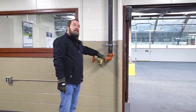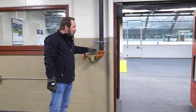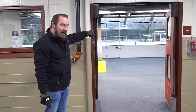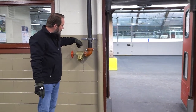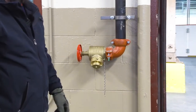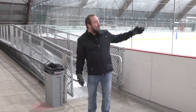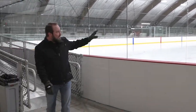This is the hose valve, off the wet system inside the main lobby and warming room. There are two of those throughout the property, and one behind the penalty box where those other two valves were — that one has galvanized pipe because it's off the dry system. Since the rink closes in summer, when you come back and get cold temperatures back in, these six valves should be checked at least once a week for the first month to make sure all water is out of the system.